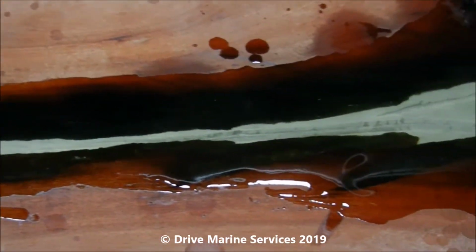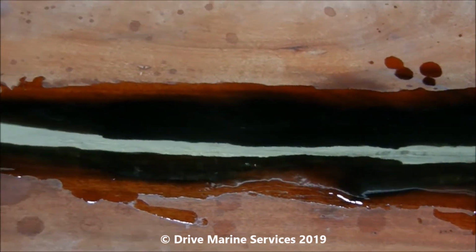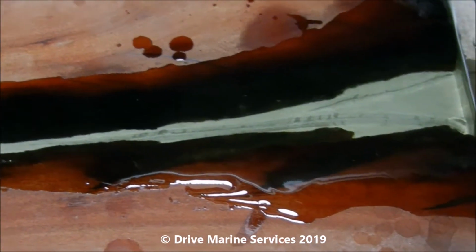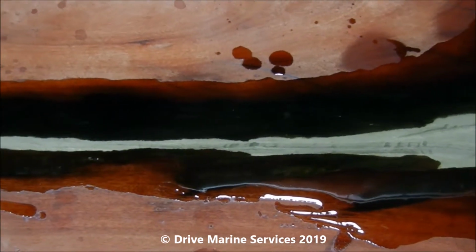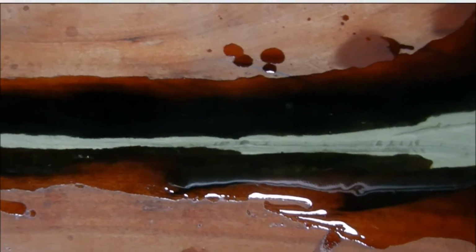I've finished doing the pour on this side, so we'll let this side cure, and then we'll sand it flat and put 3 coats of boat coat on this side, and then we've got a bit of finish off to go on the other side too, to bring it up clear underneath and flat. Anyway, she's starting to look good.